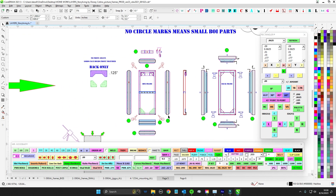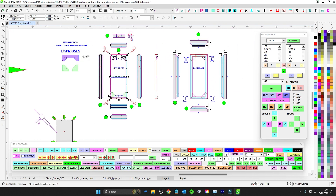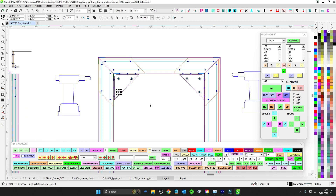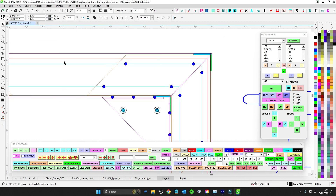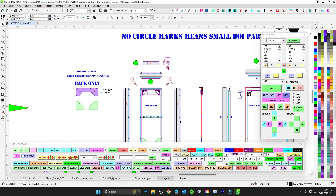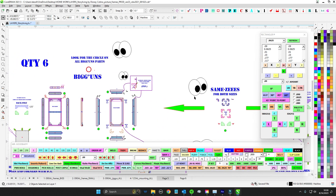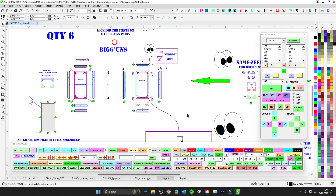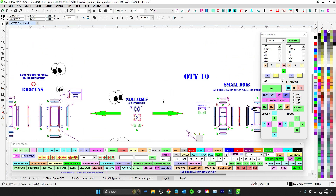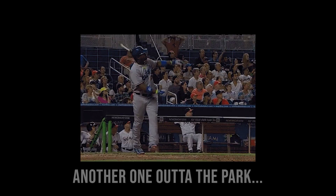When it comes time to assemble, the box frame goes to the print shop first — they put the digital print all the way around it. Then bring it back, set the box frame inside the back frame, hit number 10s in the corners to suck it together, make sure you've got your three-sixteenths gap all the way around looking good, and the box frames stick out about a quarter-inch. Then the whole unit just gets lifted up and slid down onto the hooks — done. Go quickly but take your time, make sure everything's handled properly and looking really clean. Any questions, hit me up.